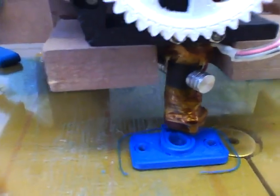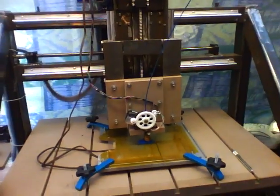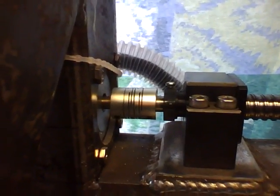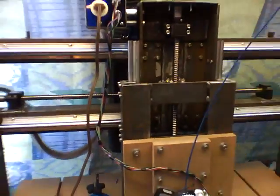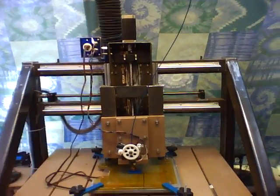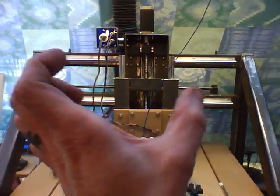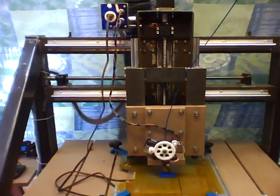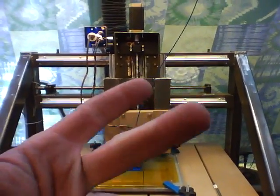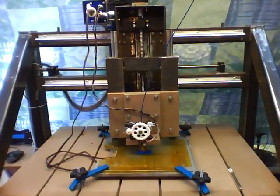The problems I have run into: number one, CNC machines are slow. This is designed to be — check this out, watch that, you see that fill? This is an extremely heavy assembly, extraordinarily heavy — 40, 50, 60 pounds. Trying to make it move fast is hard to do, involves a whole lot of power, and most importantly, is incredibly hard on the mechanics.